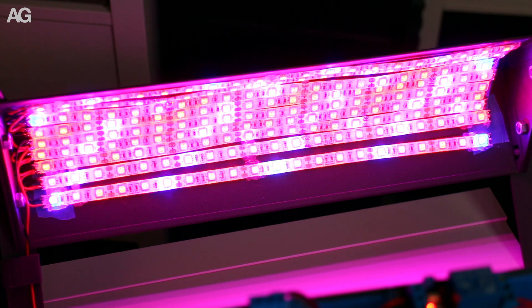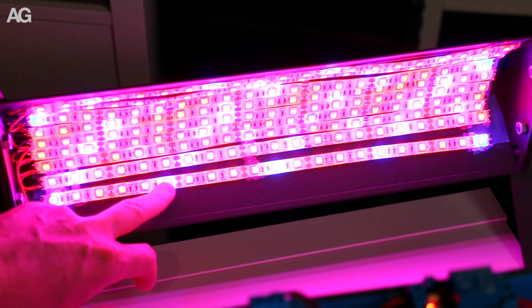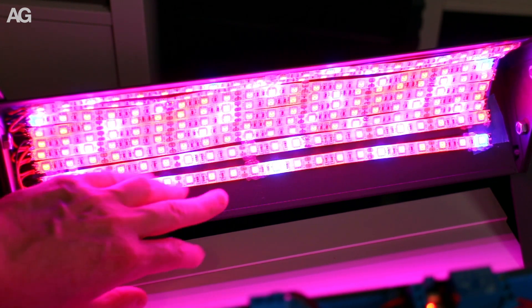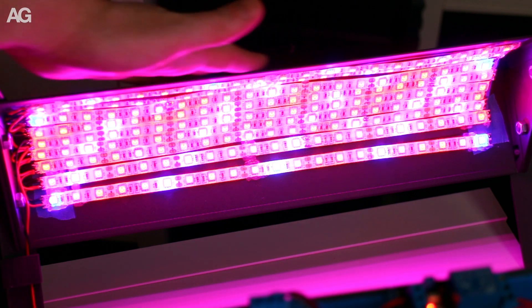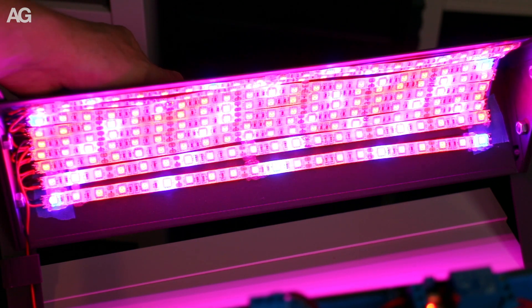The lights being used are what I think are called wide spectrum or full spectrum plant grow lights, and they consist of a mix of blue and red LEDs. I'm using a few more LEDs than before and they are generating a fair amount of heat. They are backed onto the metal top here so that does sink away most of it, but it still runs a lot warmer than I'd like.